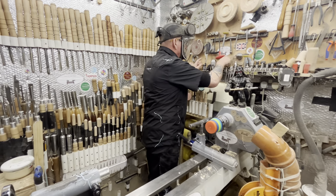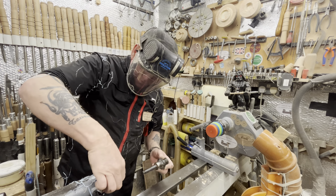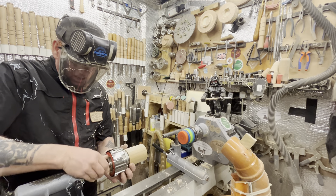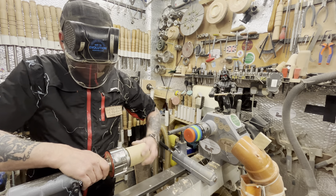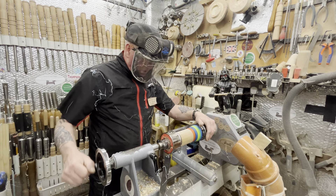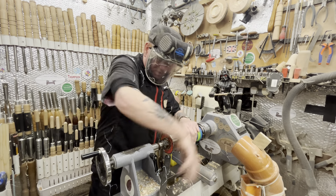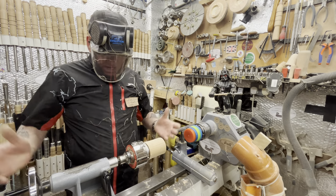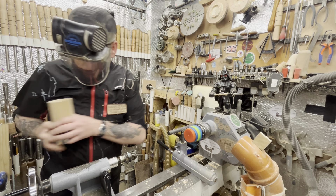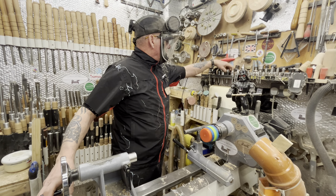I've got a nice flat bottom on that. The reason I've done it this way is because I will now put — look at that finish, look — because we rolled our cutters over we've got a beautiful finish, no chip out. That's not negative rake — I don't use negative rake for this, that's the standard type 3 set. Now all I will do — I've got a bit of resin gone in my center — is put my chuck on here, slap a load of epoxy on, bring that up, tighten it, and leave it.